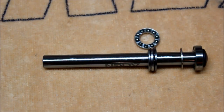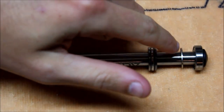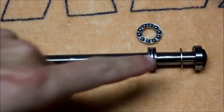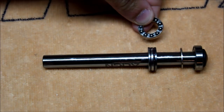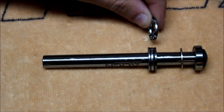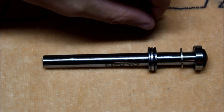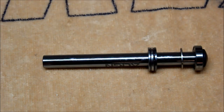Once you've greased the thrust bearing, it's very important that you reinstall it in the correct orientation. As you can see here, we've got the radial bearing, followed by the thrust washer, which is going to transfer the thrust loads through the inner race of this radial bearing to the thrust bearing — so that's a very important piece. After that, you'll see that we've got both races of the thrust bearing, with the thrust bearing cup and the balls housed between them. I install it so that the cup is facing inboard towards the center of the rotor head to help hold all the grease in the thrust bearing. Each one of these races is marked in and out — it's important that you put the inboard one closest to the rotor hub, and the out one closest to the blade grip.